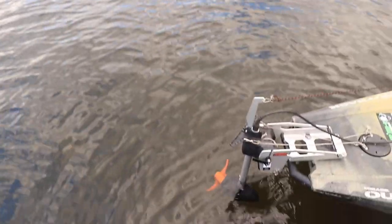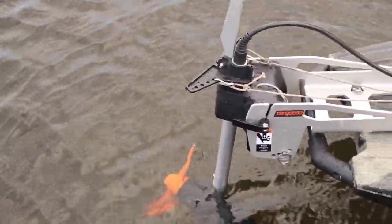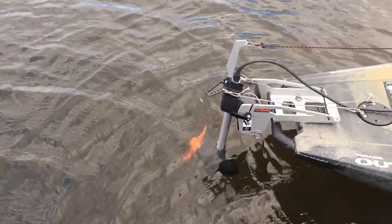I typically have a lot of weight in the back so it actually pushes the motor down. What's happening is the prop is actually pushing out of the water just a little bit, so it's not grabbing right. It's not catching the water well. The reason for that is they came out with the Torquedo newer style motors where the shaft is actually a little bit longer to go down into the water a little bit more. The problem I'm running into is I just bought the mount and put the original shaft on there. So that's something to keep in mind — the new mount comes with a new shaft so that it gets deeper in the water and can propel better.